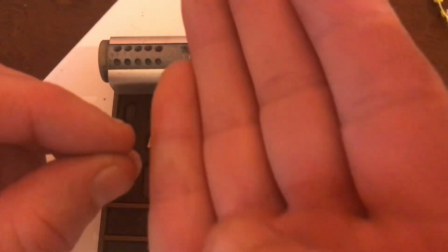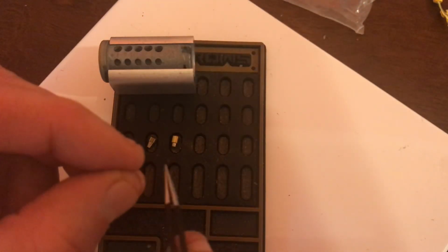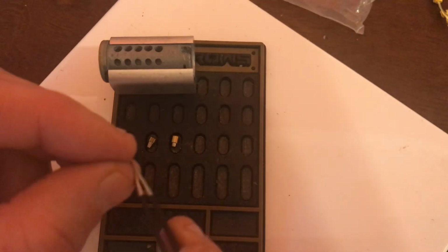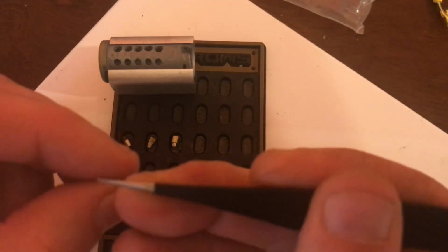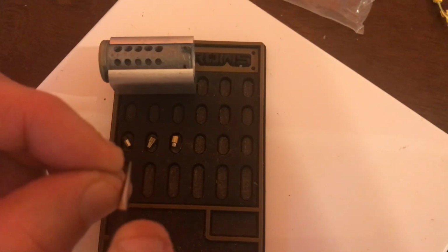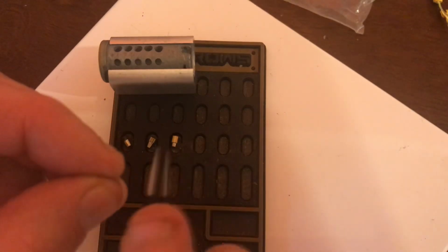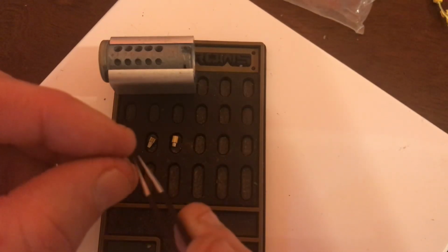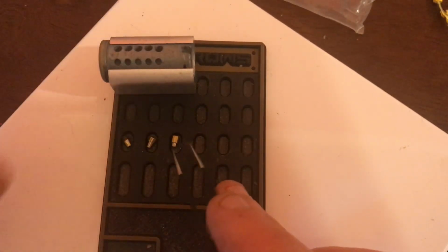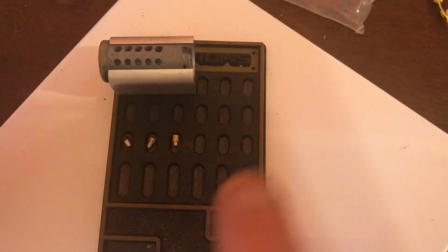very gradually turn that jewelry saw on its side and start kind of filing in and cutting in towards the chuck. That keeps the pressure of the pin going into the chuck, so it's less likely to go flying out as opposed to if you started on the inside of it and started turning and then working out. Even if you have it chucked down pretty good, the odds of you knocking that out of the chuck are pretty good. So yeah, you work it in, and you can still craft them. It's a little bit trickier for sure than just running a file across it as it's spinning, but it is doable.